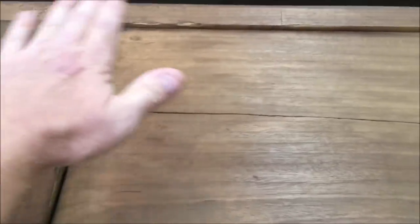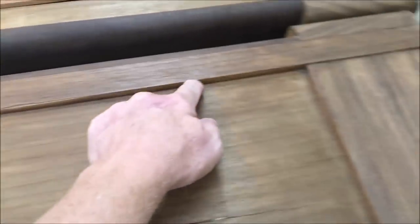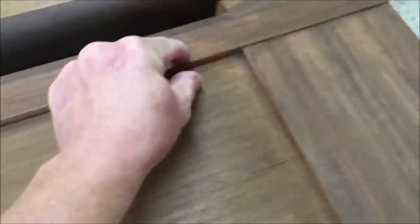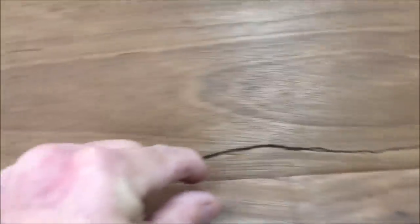There's no way to take the frame apart — it's too solidly glued together. So what I have to do is just cut the panel out with a saw. There'll be an overlap on the bottom that I'll cover with a new strip. Then there's going to be a little bit of a gap on the side, so I'll have to support it from the back side with a cleat. And then I'm going to add a bead molding all the way around to hide the edge of the panel.